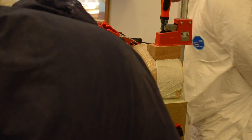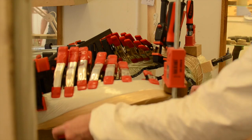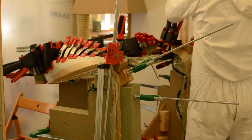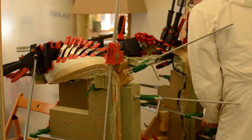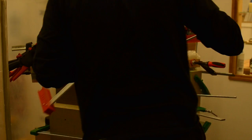This all happens with epoxy resin so with the slow hardener you've got a bit of time to manipulate everything and make sure that it's right. You'll see Tim and Graham working hard to cramp it up and make sure that all those key points are met. As long as the layers of veneer are pulled together tightly, the glue has gone off, the former has done its job, and the cramps have done their job with the veneer form pulled around that former tightly, then we'll have a successful bend.